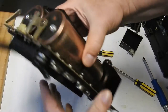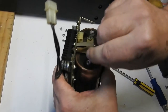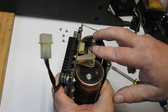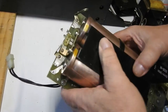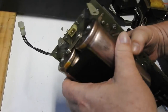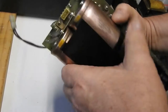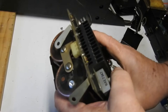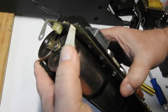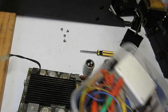Having decided to leave those capacitors in place, I put the strap back on and loosened these so I could swing the connectors away. I can just play with each capacitor independently or in parallel — doesn't matter. I suspect they're not in parallel. Ones for the minus 15 and ones for the plus 5. But one of those plus 5-volt supplies is 17 amps and the minus 15 is only 5 amps — so why the same size filter capacitors, I'm not sure. I'll stick the little multitester onto it and see what they say, before I stick any voltage in. I'll assume they're all discharged.